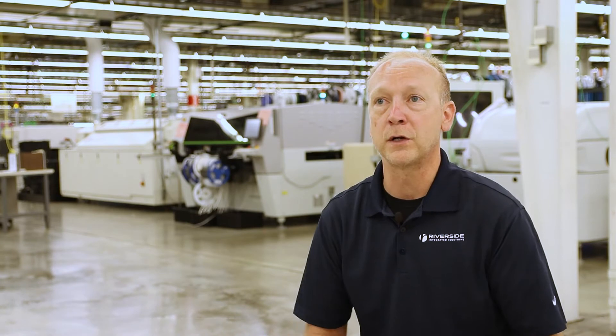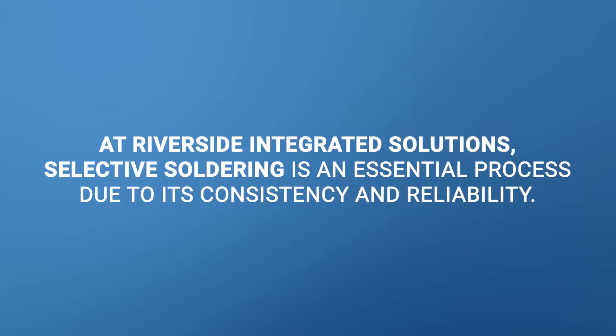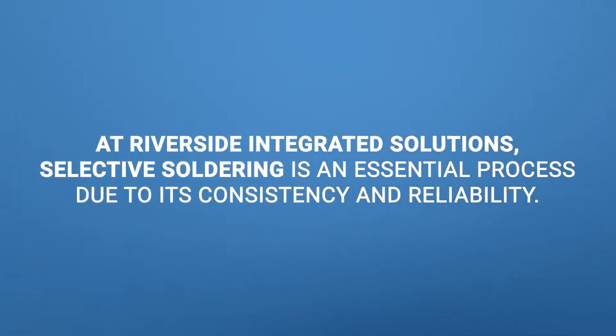Having been here for 21 or 22 years, over time we've moved from hand soldering all of those leads with a soldering iron — a human resource adding solder to each joint — to this selective solder option. It creates a lot more reliability and consistency in the product, and it reduces the tooling requirement. As our customers' products become more complex and more dense in component population on both sides of the circuit board, selective solder is really essential to serving them.